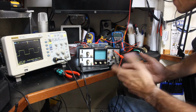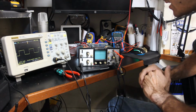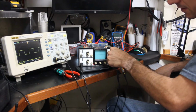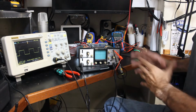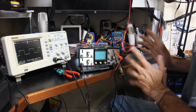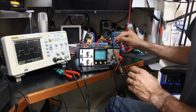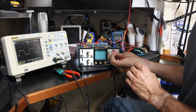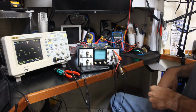So I don't know what direction that's really going to point me in just yet. Tell you what, why don't we try the most basic thing, and we'll unplug the scope and we'll clean the contacts really good. We may have some oxidation or some residue built up on the contacts that it only gets a good contact every once in a while.